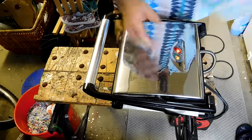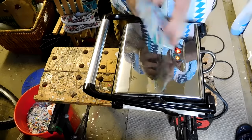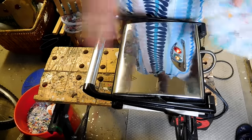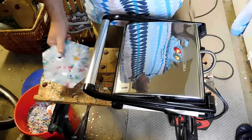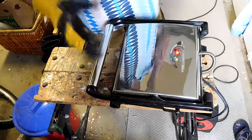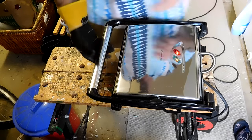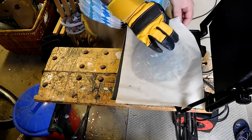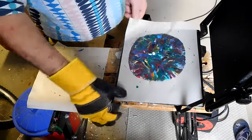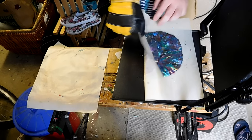In previous videos, I've actually clamped this down and forced the HDPE flat, then let it cool, and you end up with this very tough thin material. That's cut to a hexagon shape, because I had this crazy notion that I was going to make hundreds of these, somehow weld them together into a massive great big sheet and make an HDPE boat. Unfortunately, that didn't work for a variety of engineering reasons — it's actually very hard to seam weld HDPE. One of the benefits of using this sandwich toaster instead of melting in the oven or over a flame is that it only just heats up warm enough to melt HDPE, so we don't get any fumes, we just get very gently melted plastic. I'm also not scorching the HDPE, which means I've got a longer working time — I can melt this and work with it carefully rather than having to rush.